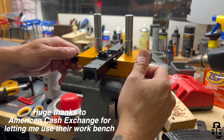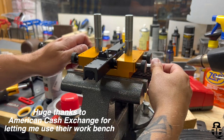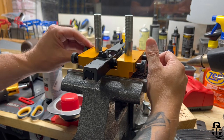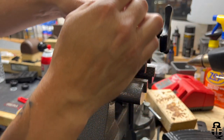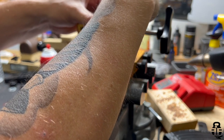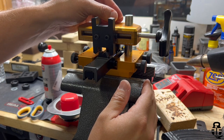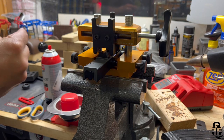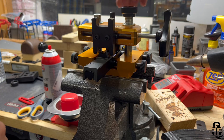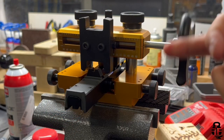I had my PSA Dagger set up in this. I went ahead and locked it down on the base, making sure it was straight using those guidelines, then gently locked everything down. I brought the top piece down, got the correct height, and made sure the slide was pushed to the correct distance. Once I had the slide in its proper position, I locked the collars down to pinch it into place.